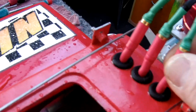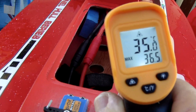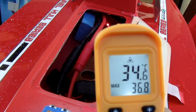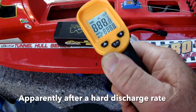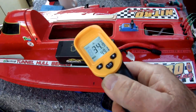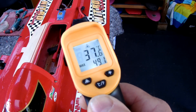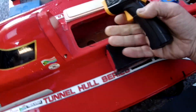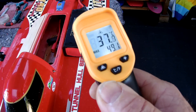The phase plugs are all holding up nicely. Let's check the battery again from this end. On the terminal side I've got 33, 35. I'll rip the battery out quickly and get a measurement in the middle of the battery. All of a sudden, 47, 48. I think the battery heats up afterwards, because when I measured it earlier it was 20 when it was in the boat. Obviously the battery somehow generates heat afterwards, after it's stationary, which is interesting. So with that air flowing over the battery, I definitely kept it cool — you saw me taking a reading inside there and it was in the 20s.